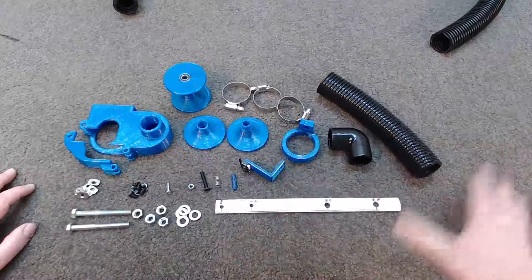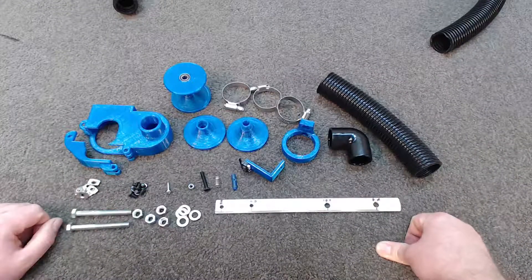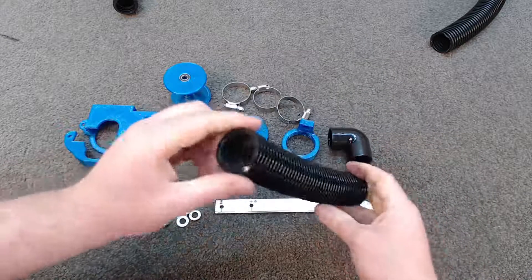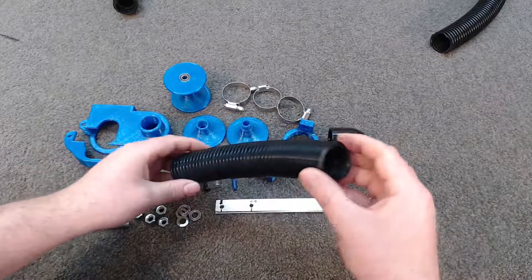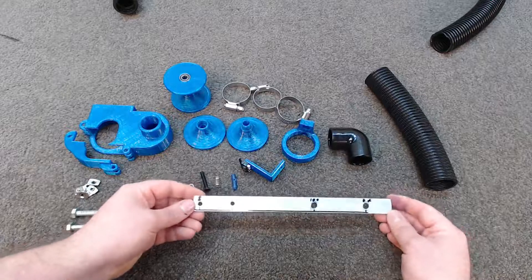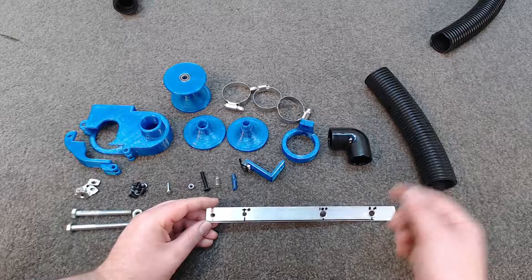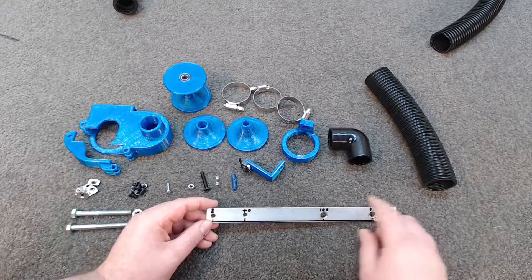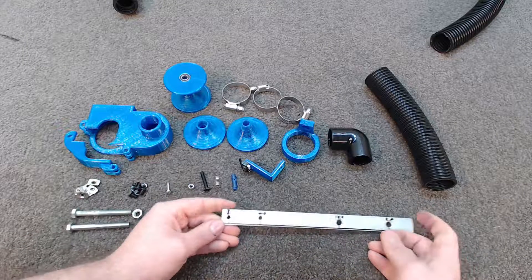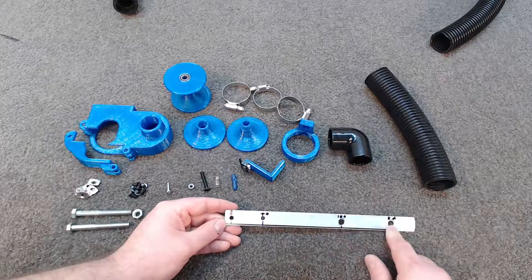This is the array of parts we need and as usual there will be a build list in the video description. I'm going to be using some vacuum cleaner hose — this measures 32mm internal and 40mm external. We've got some 20x3mm aluminium flat bar; I'm just using this size because it's handy in the workshop, but I would actually recommend some thicker material — go for something like 4 or 5mm thick because this does bend quite easily. We're going to have to drill some holes in it: these two are drilled for M5 and these two are drilled for M8.